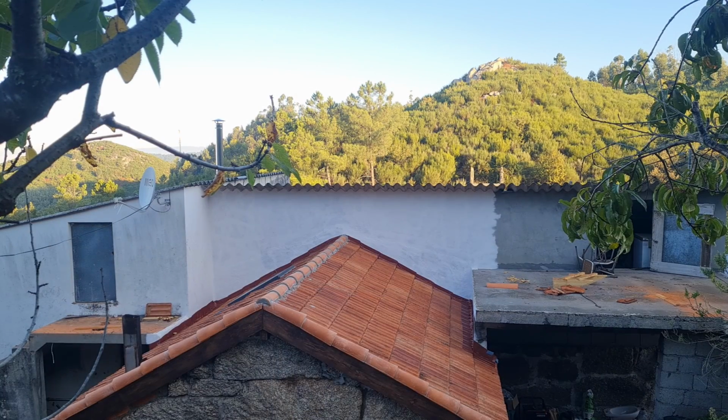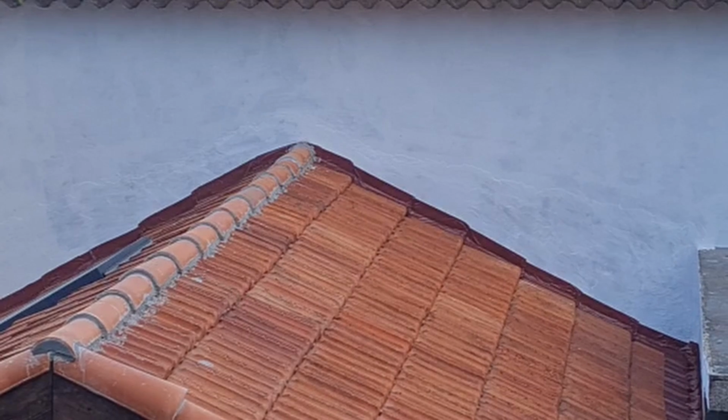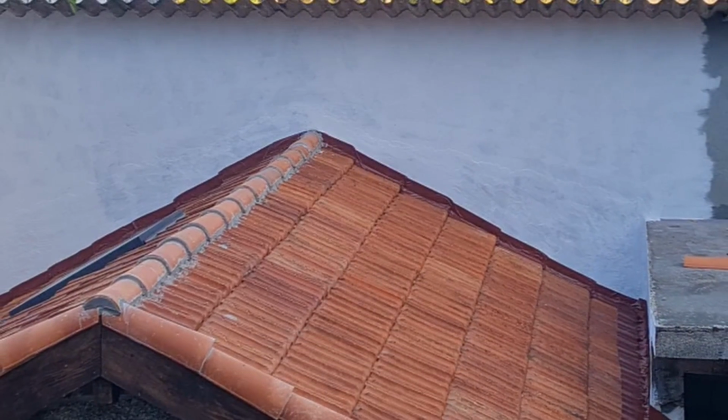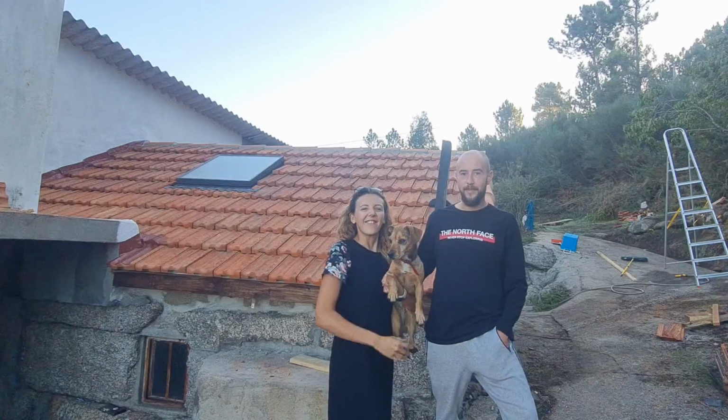So this is our roof from up above. As you might be able to see in the camera, around where it meets the walls at the house and the two side walls, we've put sticky flashing around just to double protect from any rainwater. There's a chance some might get underneath, but we have all the steel and the membrane underneath. The main house roofs slope the opposite direction from our kitchen roof, so we won't have any runoff from them onto the kitchen.